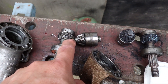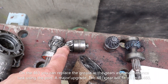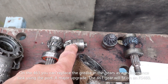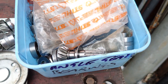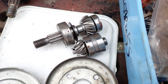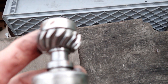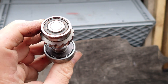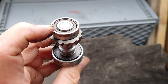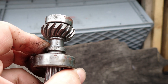When you put it together you put grease on the meshing surfaces of the angle gears, which are these. They don't seem to need to be matched pairs — the manufacturing tolerances are good enough, you can chop and change them, although I like to try and keep them as pairs. You can see in this box here it's full of usable pairs of angle gears. This one has gone a little bit tarnished in use but the bearing will be changed — and that's what it should look like, with the bearing race or cage in there and equally spaced bearings. That one is in good condition.